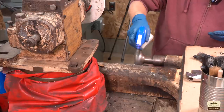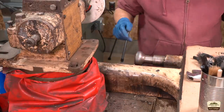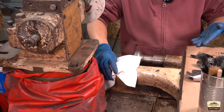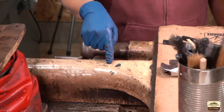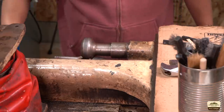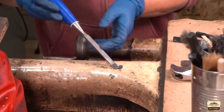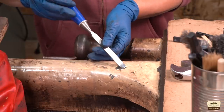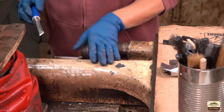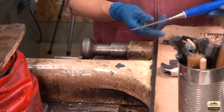It's going to take multiple iterations. If you've got neighborhood kids you can pay them a buck to do this for you — it'd be highly worth it. Now let's take a look at this chip because this is a good example. We can do our best and clean and remove all the grease, but we can't just apply filler there and paint because it's not going to stick. What you don't see is along the perimeter the oil has seeped underneath the paint — the paint just crumbles because it's all oil under there.